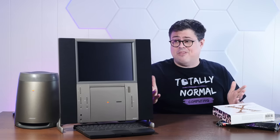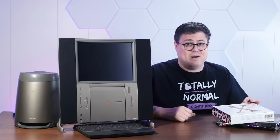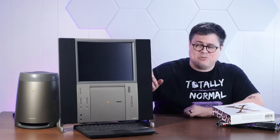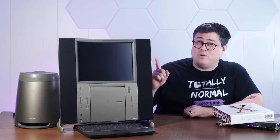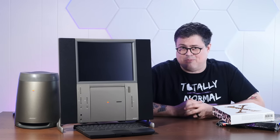So funny enough, this upgrade wasn't even planned beforehand. Colin mentioned to me on Saturday that the TAM's processor might be G3 swappable with the gear that he brought. And in fact, there was a 50-50 shot that we could do it because some 6500 motherboards had a surface mount processor and some of them had a QFP socketed processor.